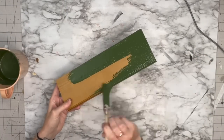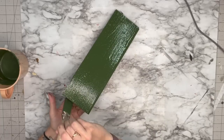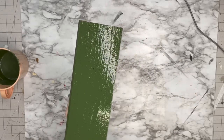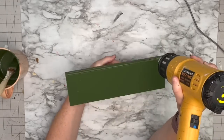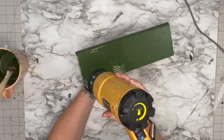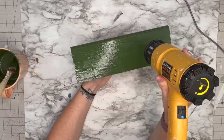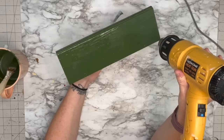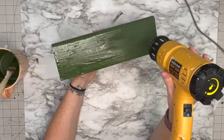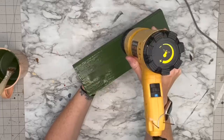Now, milk paint — as you're watching me I will explain it. Milk paint comes in a powder form, at least from DIY. You mix it with equal parts water and then you put a bonding agent in there. The bonding agent determines how chippy your finish comes out — the more bond you put, the less chippy; the less bond you put, the more chipping you're gonna get. This is my first time using it.